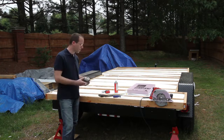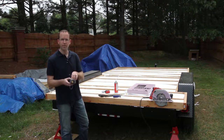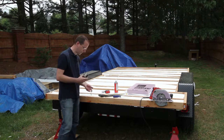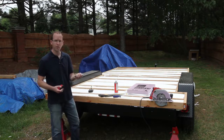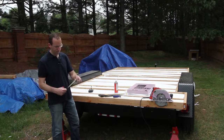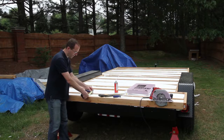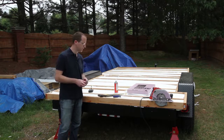To mark the insulation, I use a chalk line — a piece of string encased in a chalk-filled container. You attach it on one side, pull it tight, and pop it to leave a chalk line showing where to cut. For smaller pieces, the blade almost cuts all the way through because the foam is so thin. I'll take the measurement I need, attach the tool to the end of the blade, use my finger as a stop, rub along the flat edge, and the blade scores the material so you can just snap it — much quicker than using a saw.